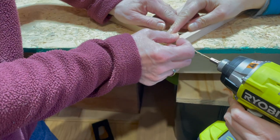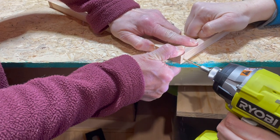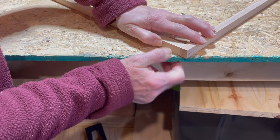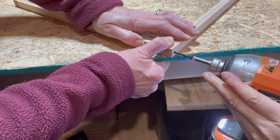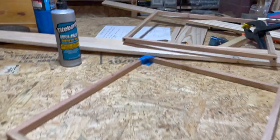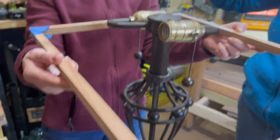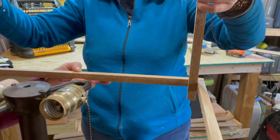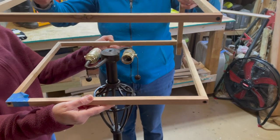We're using screws because we want a very nice long-term joint that will not come apart, but you always run the risk of splitting the wood. A pilot hole is a must for this application — make sure you make pilot holes and go slow. These are very small pieces and cedar is a soft wood. Here you see the first dry fit of the frame. This gives us a first sense of whether we need to change dimensions, and at this early stage it's easier to make changes without sacrificing material.